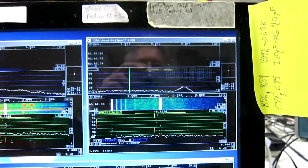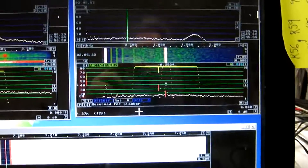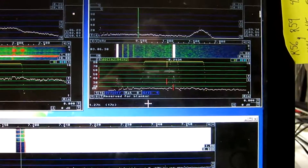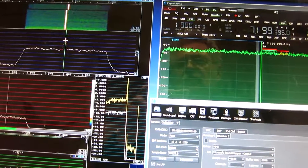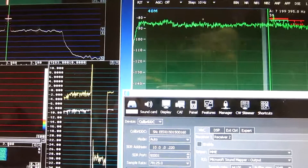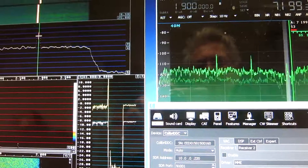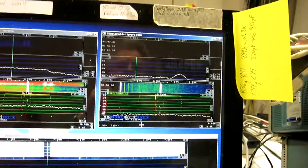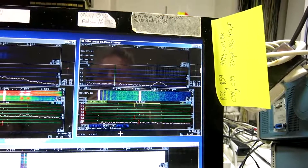For the FT-1000 — I switch off the Softrock and enable the FT-1000. This is the maximum signal I can have. Looking at the signal-to-noise ratio — the yellow track — I switch off the strong signals and there is no difference. At night the FT-1000 is very good because it has front-end filtering and strong medium wave signals do not affect it as they do with the other radios.